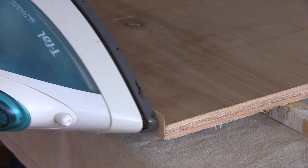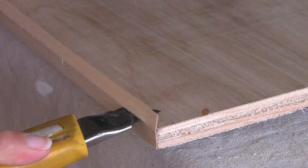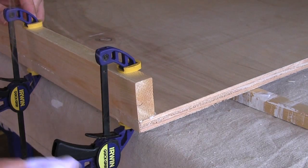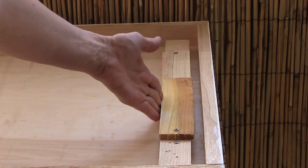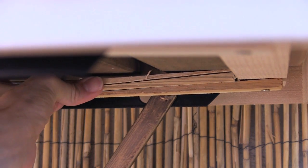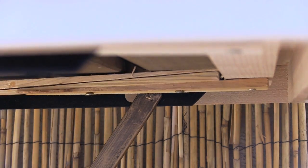This table was a little bit smaller than what I wanted, so I ended up making a top that just slips over the existing table to make it larger. To make it, I added iron-on edging to a piece of half-inch plywood that I had cut at the hardware store, and then I trimmed off the excess edging with a utility knife. I wanted the top to look a little bit more substantial, so I glued one-by-two boards to the plywood using wood glue and clamps. To keep the top in place, I added furring strips underneath the top to fit the length of the existing table, and screwed in place wood shims that pivot so that they can be extended back out after the top is on. I filled the gap between the wood shims and the existing table with more wood shims, and then I screwed them to the underside of the table so that the new top would stay in place.